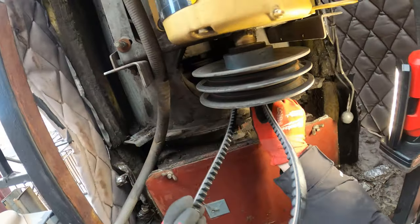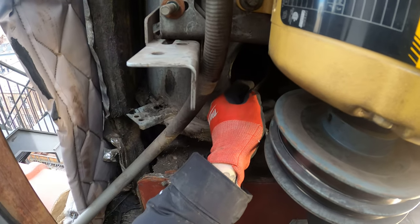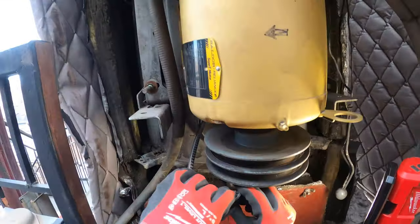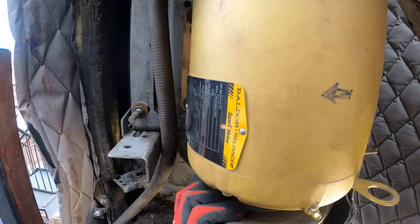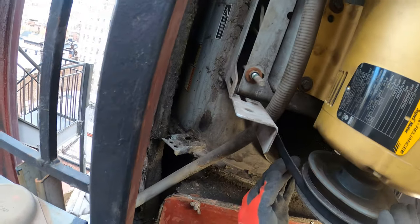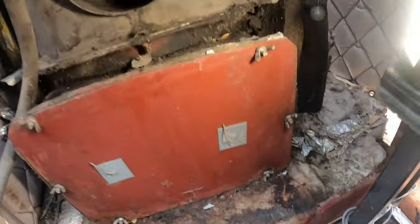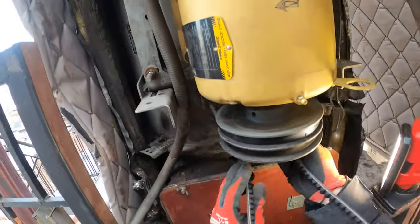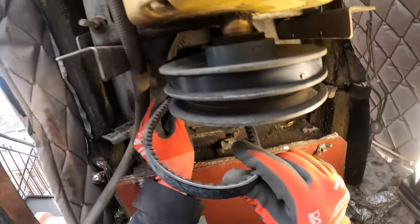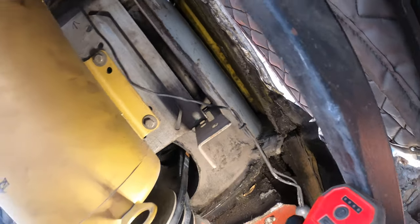Here's the new belt — let's get it inside. It's spinning heavy back there, so slow that down. You can see I caught it on the top — let's get it on the first pulley. Two fingers doing this, and then we're going to get it up on the next level. Let's throw this belt. Now going to the back to catch the bottom — swing it from the back. Got it. Our belts are on.